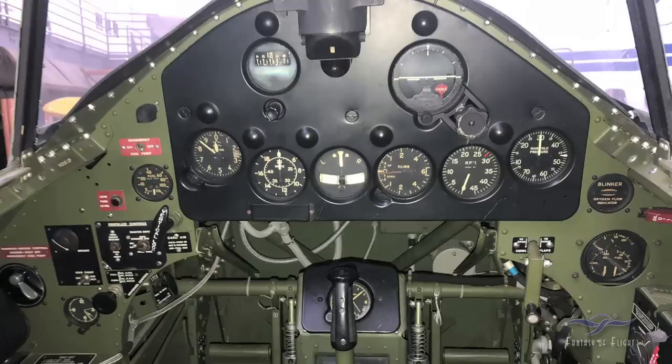So here we've got the main panel. The first thing over here on the left is our mag switch — currently in the off position. Then we'd go to left mag, then right mag, and all the way clockwise to both. When we do the engine run-up, we'd start the engine, let it turn through a couple of blades, go to both and start it. During the pre-takeoff run-up checklist we'd check both mags and look for a slight drop — anywhere from 50 to 75 RPM is acceptable. If it drops too much, you need to look at the mags or clean the plugs.